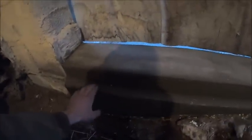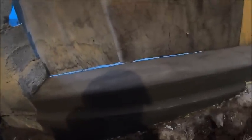I got everything, got all the great stuff pulled away from it. This ledge turned out good. This is gonna serve two purposes. A, it just gives it a little bit more meat right here since the original footer fell off. So it just gives it a little bit more meat to back it up right here. And then when we come in eventually and pour the new floor, it gives the new floor something to set on top of, just like it would have down there.